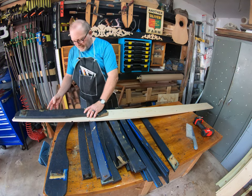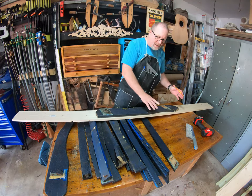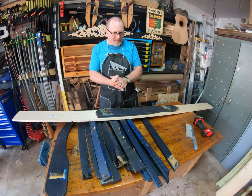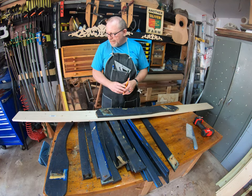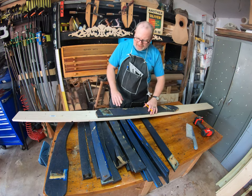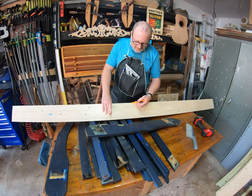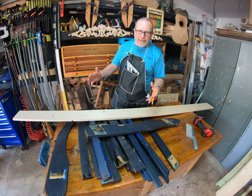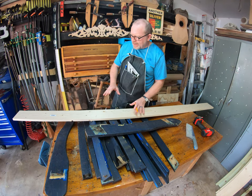You want to lay out your really big pieces, like the leg runner and the arm, on your piece of wood. I carry two pencils — a wide pencil and a narrow pencil — and mark the big cuts for all your pieces. When you build something with wood, your first step is the plan and design. Next, make your rough cuts: cut your large pieces of lumber, whether sheet goods like plywood or dimensional lumber like this, down to the basic length you need. Always cut your big pieces first — that's a better use of your lumber. The small pieces can use off-cuts at the end.